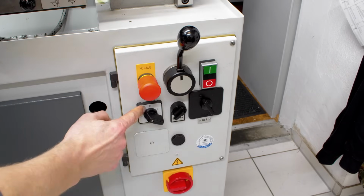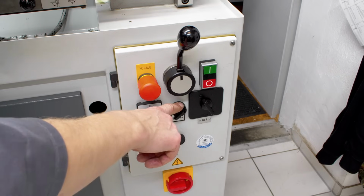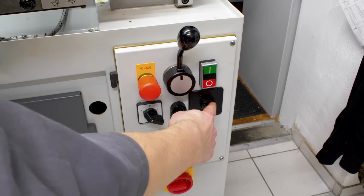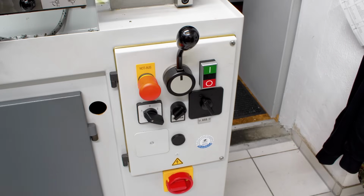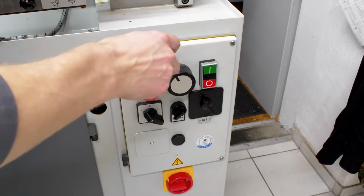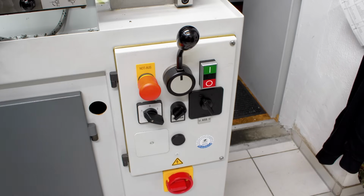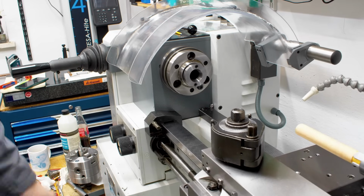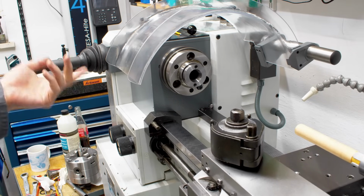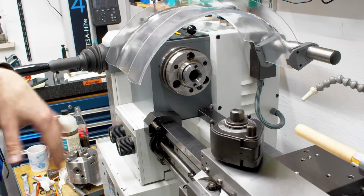You have the two speeds of the motor, the brake, it's a braked motor, and the coolant pump. And up here, this is spindle on, left and right. The large ka-clonk noise that you hear, that's the spindle brake. So the idea with the brake is you can either run the machine completely without a brake. It just goes to a stop from the friction in the entire system.